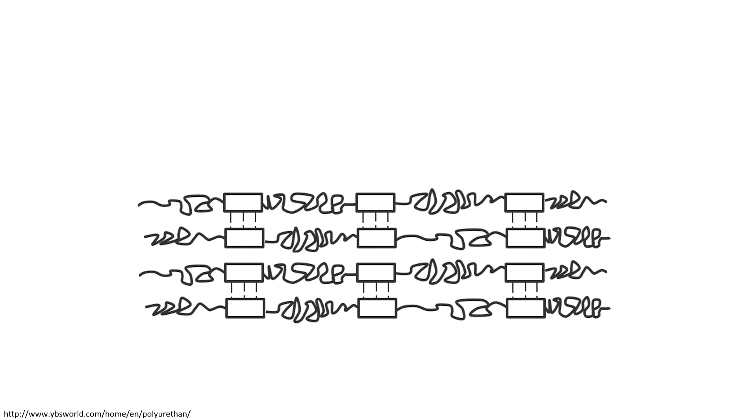The small hard sections are polar allowing them to create pseudo-crystalline areas — that is, areas with organized structure — whereas the soft sections are non-polar and make a surrounding flexible matrix. Therefore the hard areas are physical crosslinks which give strength while the soft areas allow for elongation. Both of these factors play a similar role to sulfur in natural rubber, however they are more effective overall making polyurethanes much more durable.